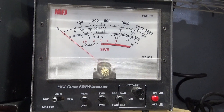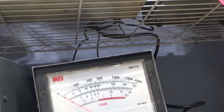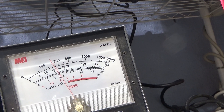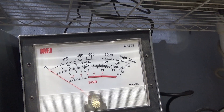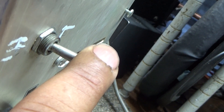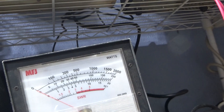It should be warmed up and ready to go. We're on the 20 watt scale over here. Keying it up, it's dead keying 3 watts. If we put it inline it'll do just under 4, but we put the modulator in line and didn't re-peak it. Doing about two and three-quarter watts, and with audio it's talking about seven on average. Whistling up to nine - some tube radios barely want to swing at all, so that's great swing. On high it keys about five and a half, and if I re-peaked it and took that inline it would actually do about seven.